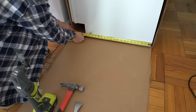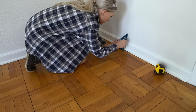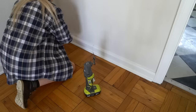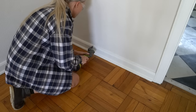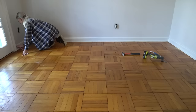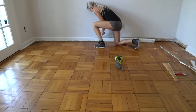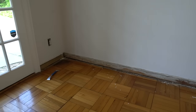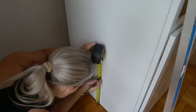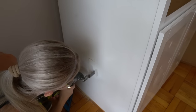First, I measured the base of the cabinet and then transferred that measurement to my wall. Then I used a utility blade and my multi-tool to remove the base trim where my cabinets will go. I took a measurement for my outlet and transferred that to my base cabinet, then used my multi-tool to notch out for the outlet. I'll link the tools that I used in the description below.